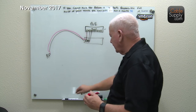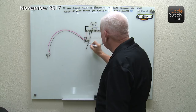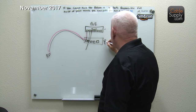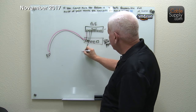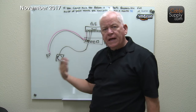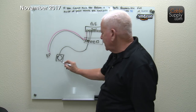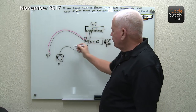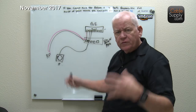It not only can power that AP site, it can also power a camera — an IP camera that's capable of receiving power over Ethernet. The power goes through the same cord; there are no special patch cords or cabling required. It just goes over the existing system, so you don't have to re-cable your whole building.